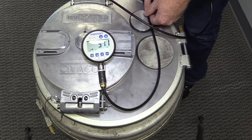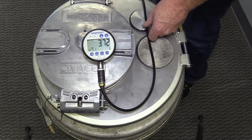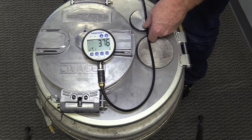Gradually apply pressure to the tank and observe the pressure gauge for the point of relieving pressure per the DOT regulations. Once relieving pressure is achieved, note the pressure and lock the air supply to the test fixture.